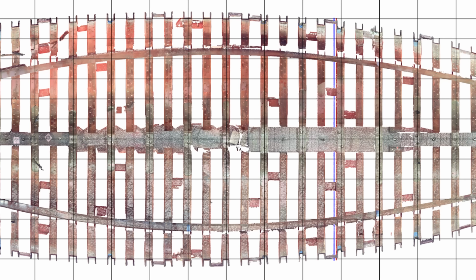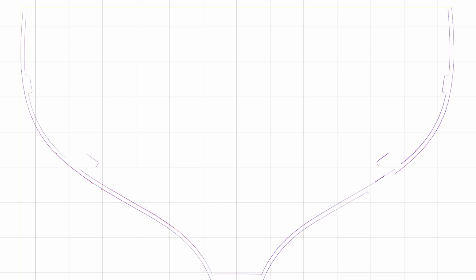Essentially, you can create a cross-section of the boat at any position you want and then transfer that into a two-dimensional shape which you can get printed out and then cut out and fit inside the boat. Originally, we were hoping that we might be able to use those templates to actually cut out our final bulkheads without actually making any traditional patterns at all, but we didn't quite get to that point. The data itself is very accurate, but through the process of exporting it and printing it and so on, we end up with a thicker line than we would like.